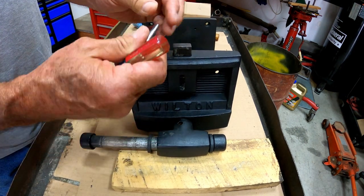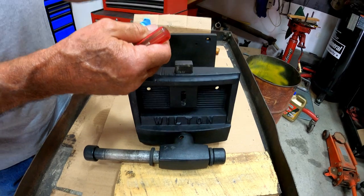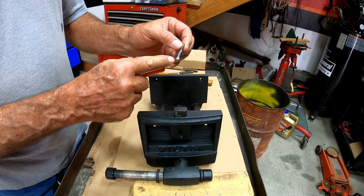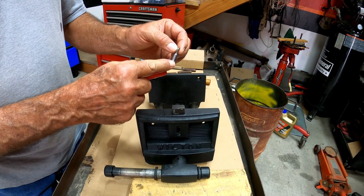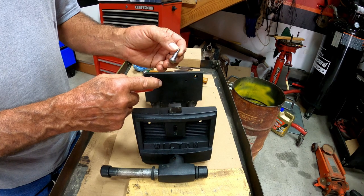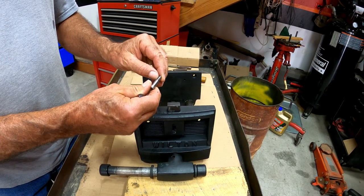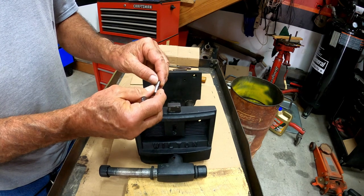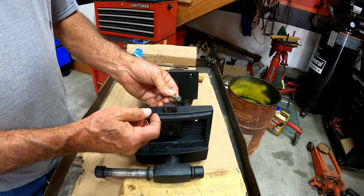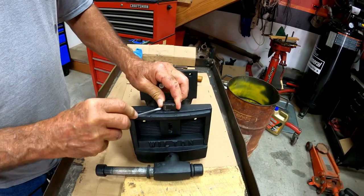This one was missing a pin. I made the pin out of a bolt — just stuck the bolt up in a drill press, used a file and filed it round. It doesn't look really like the original, but it functions. Later on I'll use some epoxy or some kind of cement; I hadn't decided what I'm going to use — nothing real permanent — so you can still get this piece out if you want to pry it out.